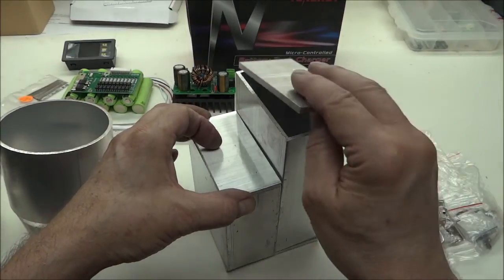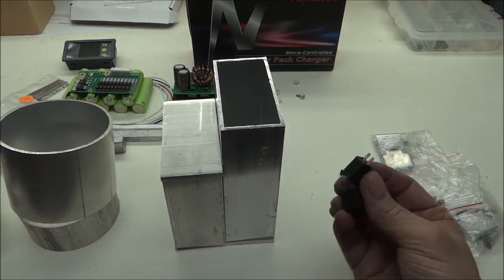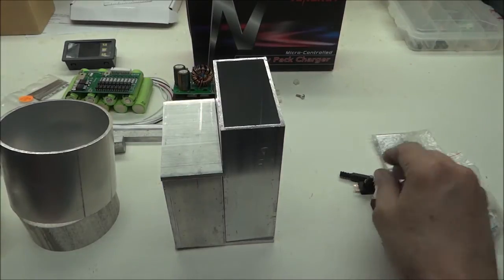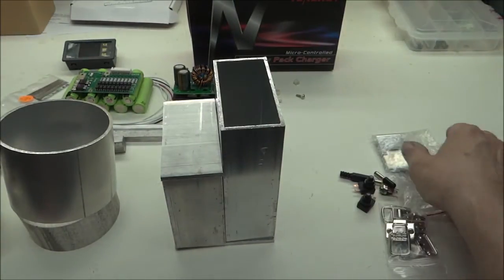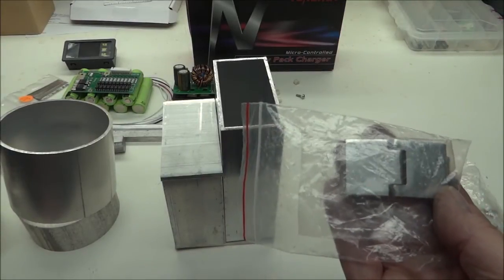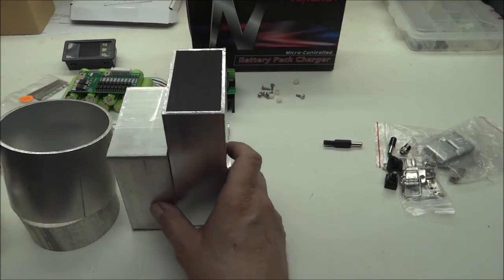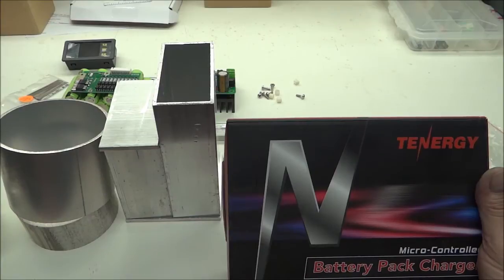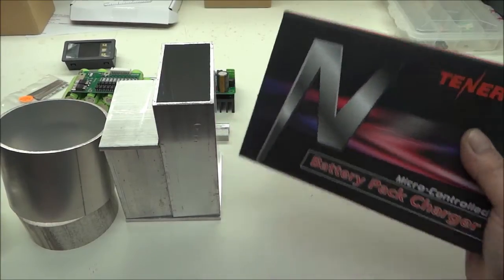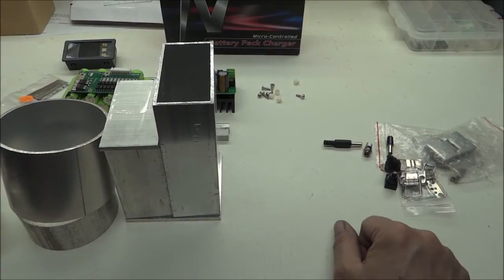The smaller pieces of flat aluminum stock are for the end caps of both tubes. This one is not going to be hinged, but the one where the batteries are will be hinged. I'll also use probably one or two Judco 10-amp switches for shutting off and turning on things. I have a couple of latches and some polished aluminum hinges for the door. I also have a Tenergy charger — a battery pack charger that should do nine to ten cells in series — so I'll be putting a charging port in the light as well.